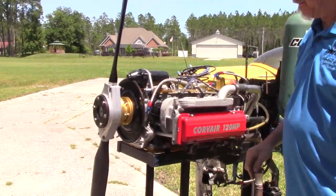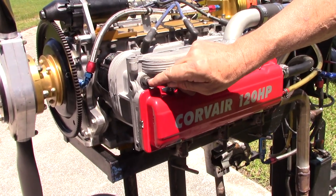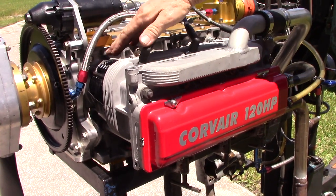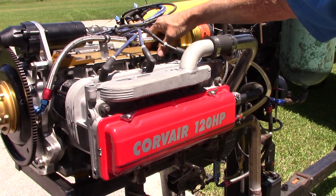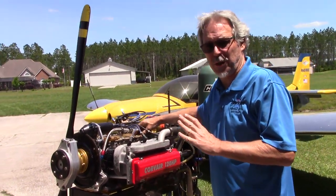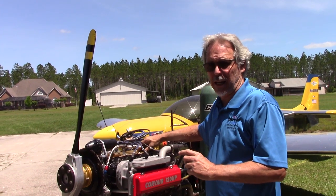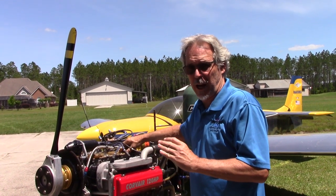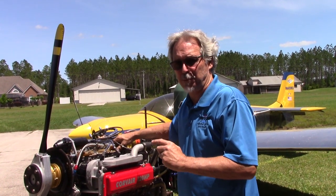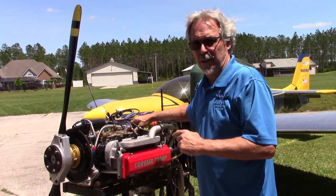Again, the smaller valve cover clamps on powder-coated valve covers. The dark look on the stud is actually the ARP lubricant — that is the grade 9 nut. These are the 3-liter cylinders. Internally, this motor is built with a billet crank and billet rods. The billet cranks from SPA are first-class units — the billets are Timken billets made in the United States, and the cranks themselves are made here too. There have been zero failures on these crankshafts in their 10-year lifespan. They're excellent products, worked harder in SPA Panthers than any other aircraft.